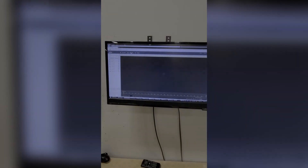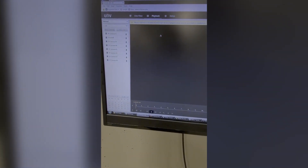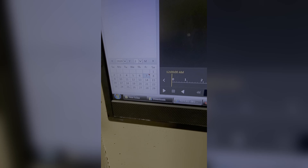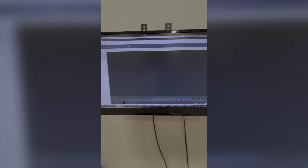Let's move over to the playback tab. I'm still learning this myself so bear with me — luckily it's pretty similar to the H series line that we carry. Over on the left side you get your device list. If you select camera 1, the timeline gets populated and you can see there's event recordings as well as continuous. You don't have to scrub through footage the entire time — you can click exactly where an event happens. You also get the calendar to select the day and see which days have recordings. Pretty similar to our H series line, so there's not much of a learning curve.